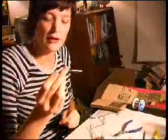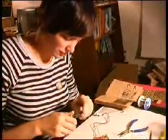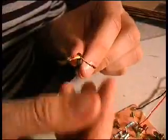This is the 3.5mm plug plus cable through which the audio will come in. First we're going to strip it. Inside your cable are 3 or 2 wires. 2 of these you bind together. So the 2 center cables, this is basically right and left together, and the other one on its own. And you solder these to the board.